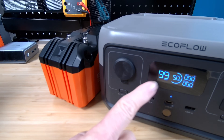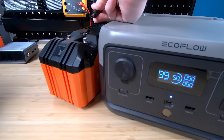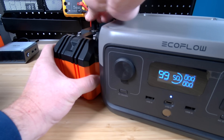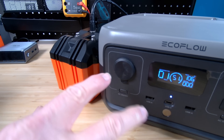I wanted to show you what we're starting off with. I've got this EcoFlow River 2 here at about 50% capacity. I've got the XT60 cable plugged into the back. This is kind of short — I'm sure you can get longer versions, or you can make your own. I've got the 5525 right here ready to plug in. Let's open this flap, cross our fingers, and plug it in. We've got some power coming in — it's ramping up: 100, 110. And boom, just like that, it's leveling out at 107 watts and it's charging. I'm going to let this charge for a while and monitor it. I would not just walk away from this — I want to see what it's doing and make sure it's staying right at that 110 watts or so.